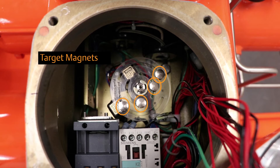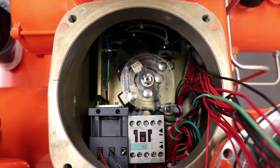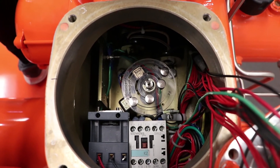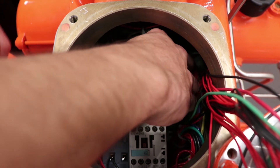In order to adjust the limit switches of the SmartEHO, you will need to move the target magnets. First, ensure the actuator is in the closed position. Push down on the target magnet for closed limit switch 2 and move clockwise until it is off the limit switch.